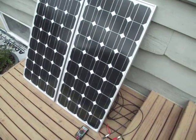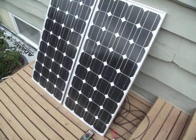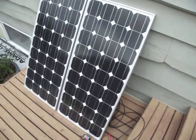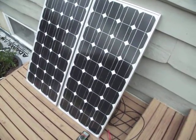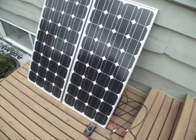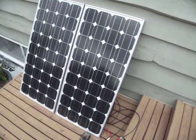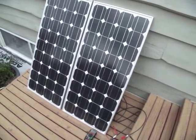It's not that they've gone and taken this particular panel and hooked extra diodes between cells — that's what I thought at first, but it isn't. It's in the actual structure of the cell and how it handles partial shading, cloud cover, or a leaf that falls on your solar panel. They're just a little bit more tolerant for that.